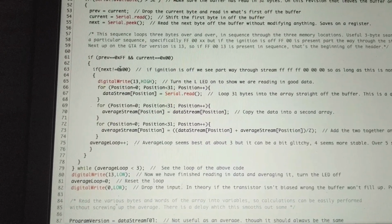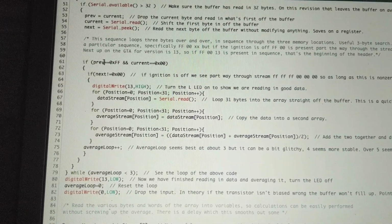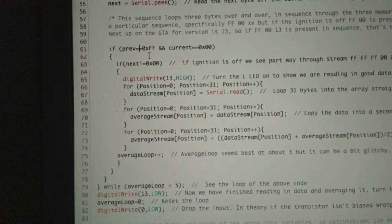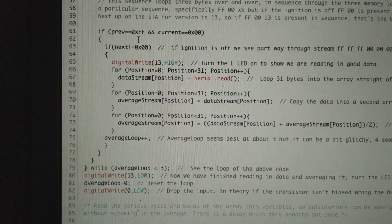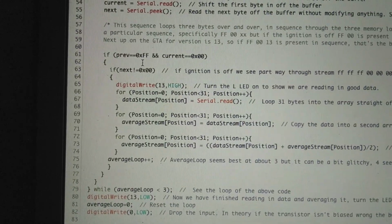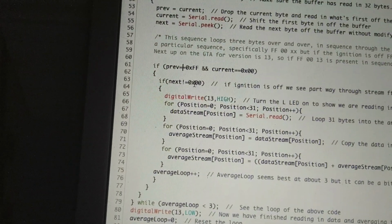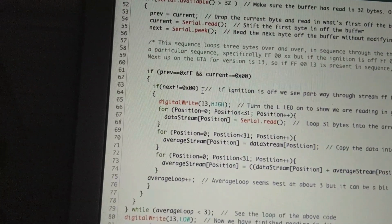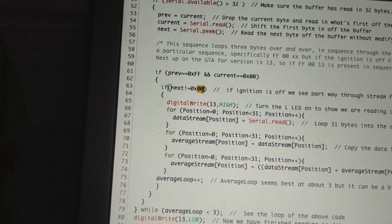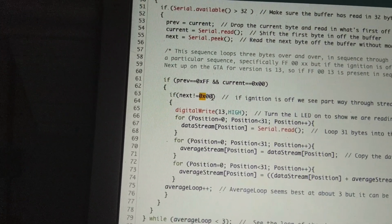So on my version, I set this so that if it's equal to, notice it's a double equal. There's a difference between comparators and setting something equal to something. If there are 2 equal signs, it's asking if it's equal to. If there's 1, it's setting it equal to. But anyway, it would check if it's equal to the program number, which on mine is 177, so I just type that in. Or if you want to keep the hex, you would modify this to B1. This 0x in front is telling you that the next number is hex, so this is hexadecimal.